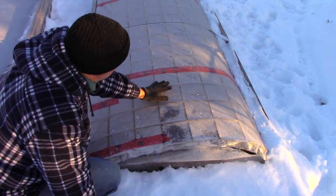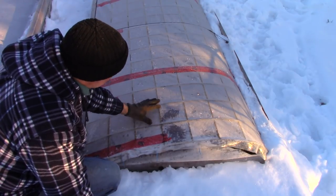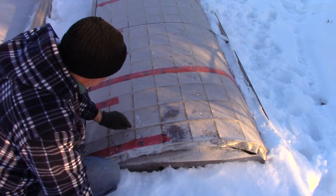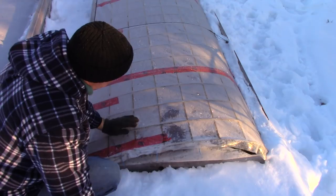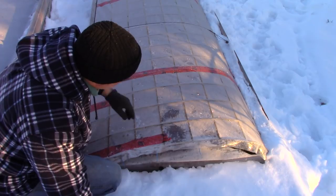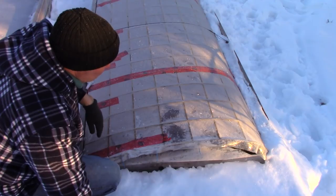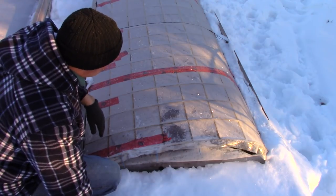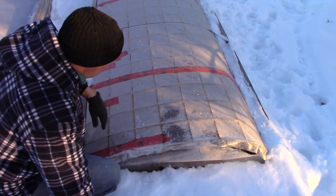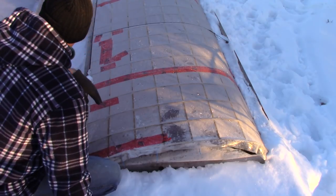You need a lot of the actual metal underneath here. You need a grid, basically. You need a matrix. You need webbing. I'm not finding the right term here, but basically this mesh, right? You want each rib that goes across as close together as possible, and the side supports as close together as possible. Otherwise, the plastic will bend and dip, and it will collect water and so on. I like the wire remesh because once you form it into shape, it's very stiff and it just seems to hold its shape very well. So I like that approach.